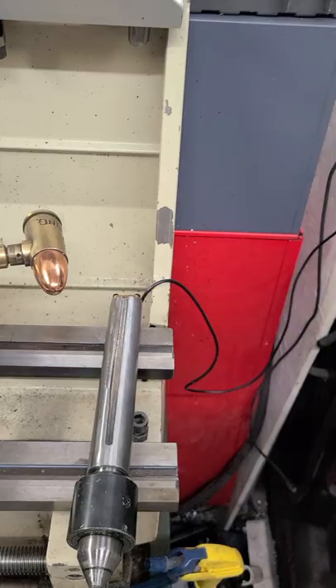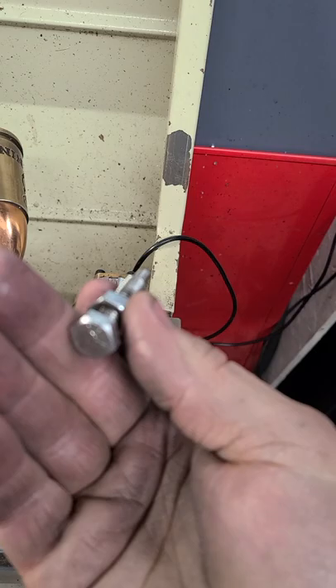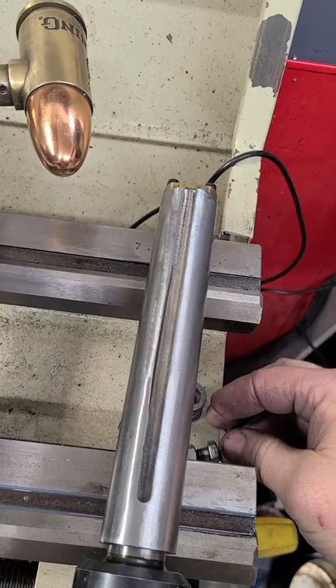That is the item that sits inside. So all I've got left to do is cut this. But instead of doing a flat bottom, what I'm going to do is come in with a ball end mill. That way — I mean, that's the idea, I'm going to try that at first — that way there's not an angle and it's less likely to swage up. And when I go to make another bolt, I've got some grade eights over here, I'm going to round the end of it. That way it fits smooth and it's less likely to try to push and swage the material up.